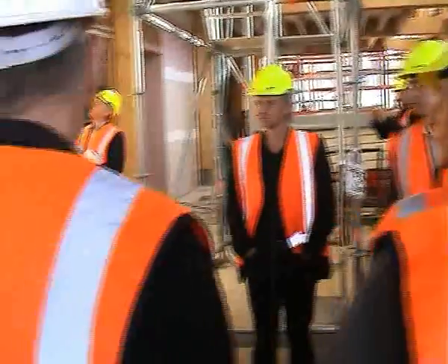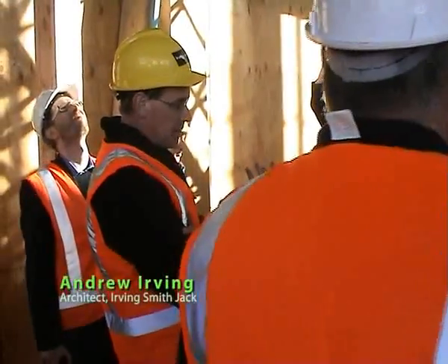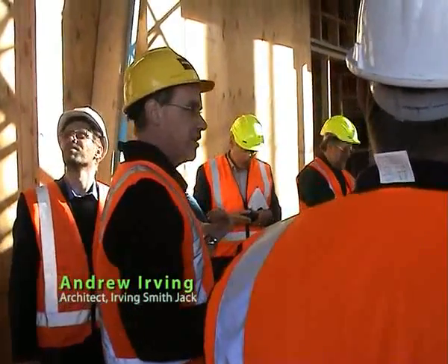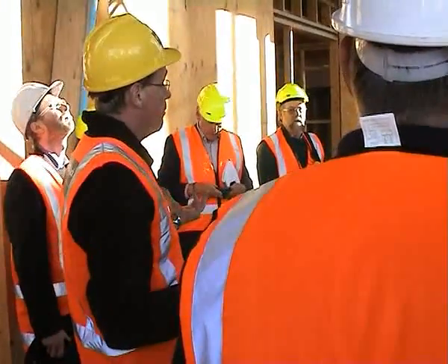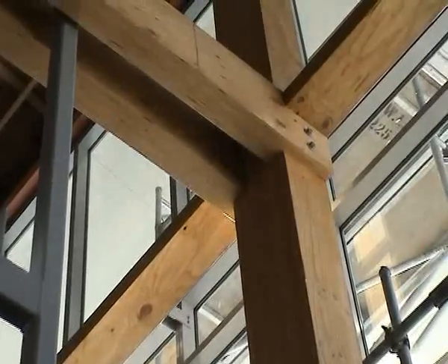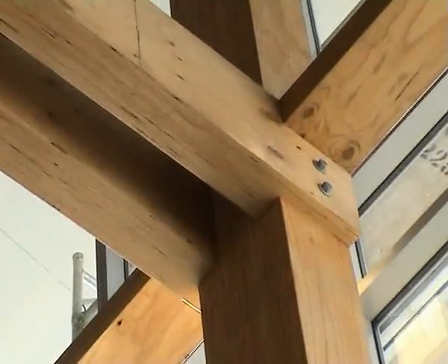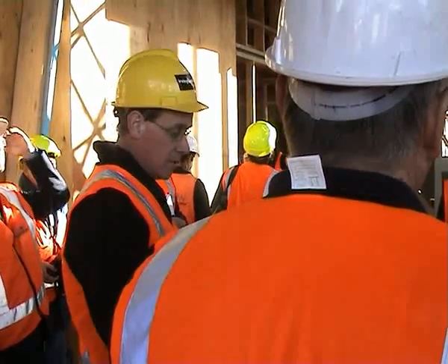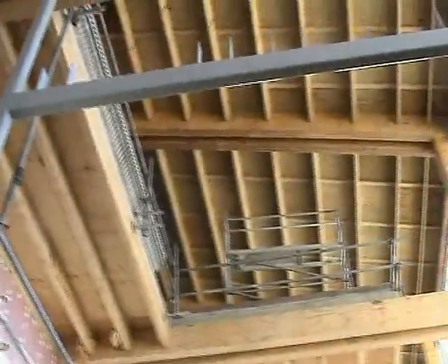If you take a step back from the detailed design, the building is dual in nature. The shear walls are really quite sophisticated in terms of the structure and the technology involved in building them, but the rest of the timber structure is about as simple as it could possibly be — four columns, three bolts holding everything together, pairs of beams. All the structure you can see now will be on show.